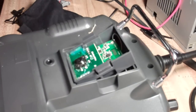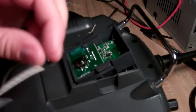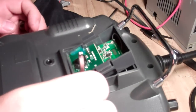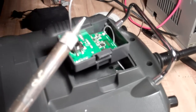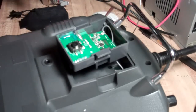So we just want to take one of these 1K resistors. Take a pair of tweezers and make sure you can grab the 603 resistor. Next you want a nice clean tip on your soldering iron — we're going to put a little bit of solder on and clean it off. You can use a sponge; I like these brass steel wool. It gives a nice clean tip.